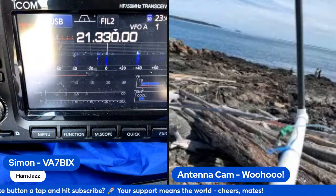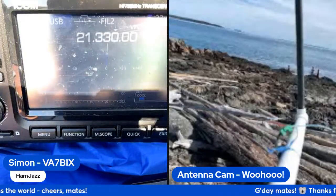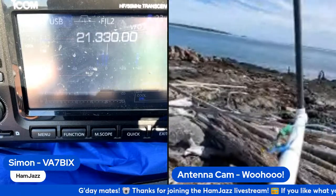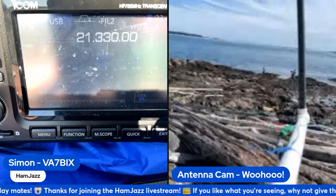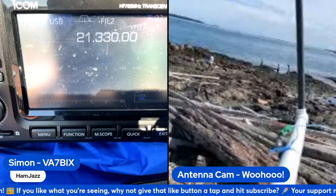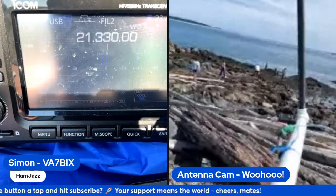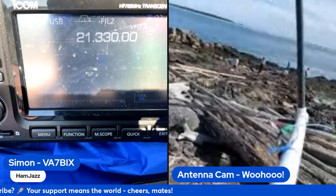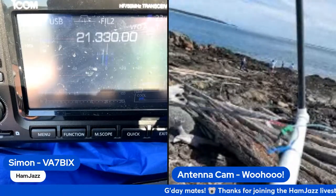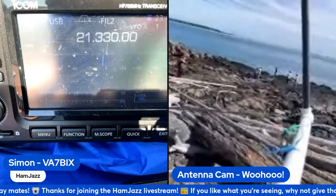Have a great day. I'll just leave that on, and I'm going to give you a bit of entertainment while I change the antenna. K&D is clear for 70, everybody. Over to you, Bob. Okay, Roger. I'd be up for the final. You've got a great station there, and probably your hardline and everything else. I think the only coax you've got is what's going up the tower. It's not a bad idea to have somebody check it every so often. Open up the antenna at the feed point and just check the SWR with an SWR meter, see if you've got any line loss. Anyway, we'll contact you tomorrow. You have a good morning over there. Good practice, and see you in a little bit.